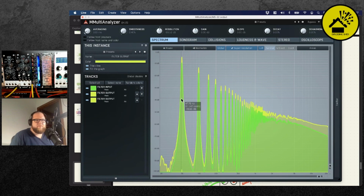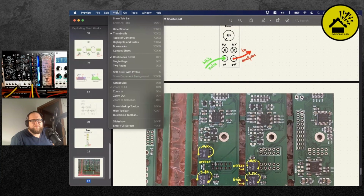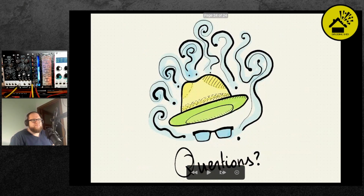All right. So that's also still an important note I need to make. If you truly get lost with the calibration, you can measure the resistances of the trimmers using a multimeter and set them to these values. These values, I've measured 10 modules in the past, and these are the averages of the calibrated values. So if you're truly lost, using a multimeter and setting the trimmers to these values should give you a decent result, or a decent starting point. And then, yeah, that's it.